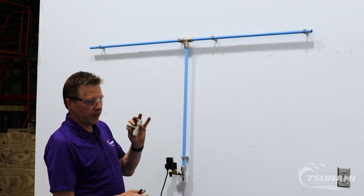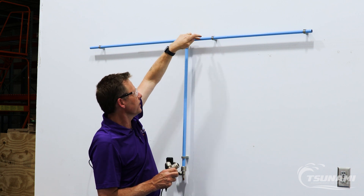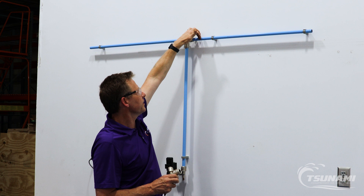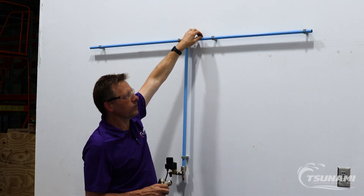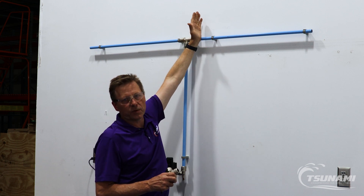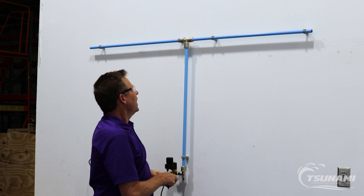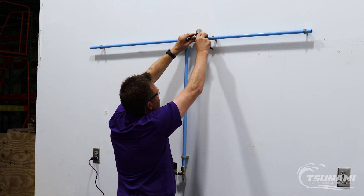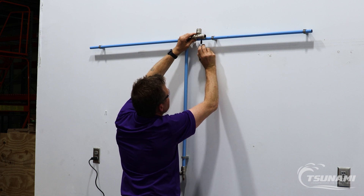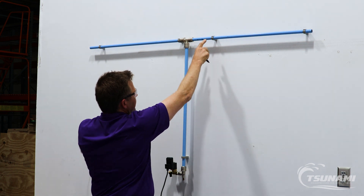The first thing I'm going to want to do is get a T-fitting. Some aluminum pipe manufacturers have special fittings where they have you drill a hole in the top or side of the pipe, and it clamps on to create that drop. It's great that they have you pulling air from the top of your header pipe to help prevent water from running down to your airline, but it's always advisable to have that six-inch riser pipe coming up, over, and down — water is going to have a much harder time going up six inches than one inch. So I want to take my T-fitting, mark it out, cut it with the hacksaw, and tie this T into here.